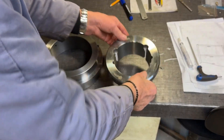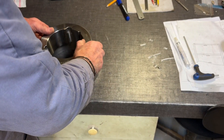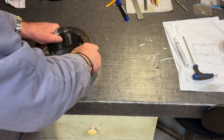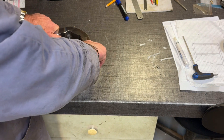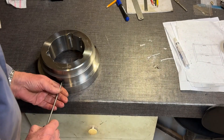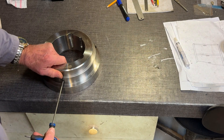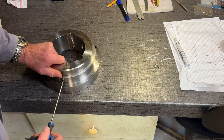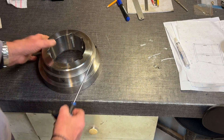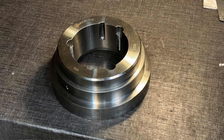The face of the pulley has got a one degree taper on both sides, with a land in the middle of about 8mm — the land being the parallel part. The idea of the taper on each side is just to make sure that the belt stays in the middle of the pulley when it's running. We just line up the grub screws, spin that round, put another grub screw in, and there we have the completed item.